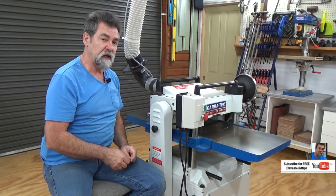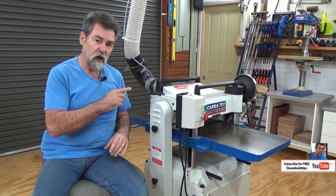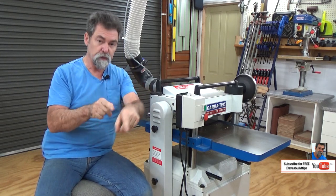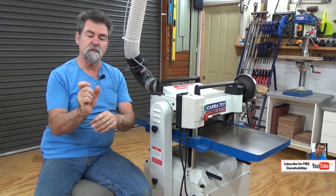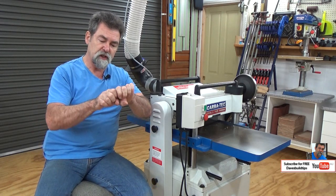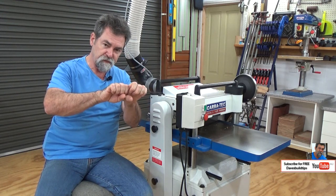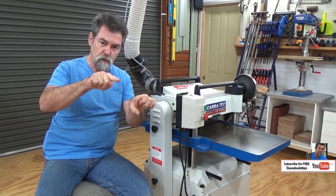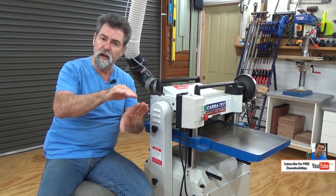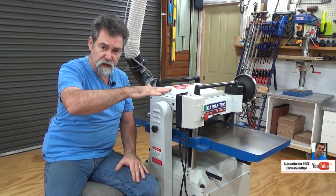The main advantage of a helical head is a much cleaner cut. The knives on this machine all face directly forward — a flat cutter about half an inch wide. On other machines the blades are tipped over on an angle slightly. If they were straight flat cutters you'd end up with a saw tooth pattern, so to compensate, those cutters are slightly rounded on the front, which gives a slight scalloping that you need to give a light sand.